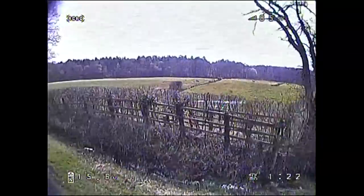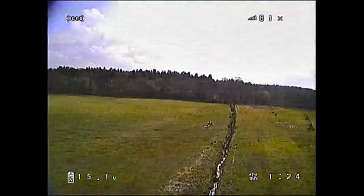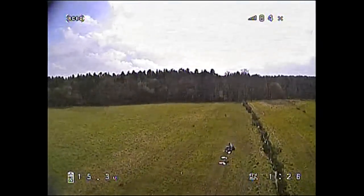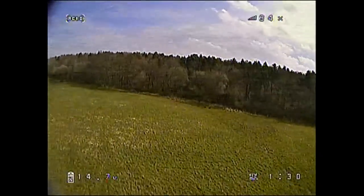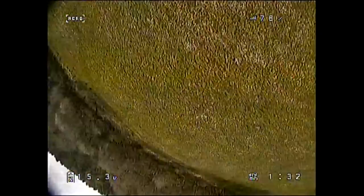I was doing a bit of PID tuning using the OSD — that was fine. The only issues I had were a little bit of noise on the camera, perhaps coming from the ESCs, and the OSD was flicking on and off occasionally. I knew the OSD problem was possibly a grounding one, to make sure I had a common ground between camera, VTX, and the flight controller itself.